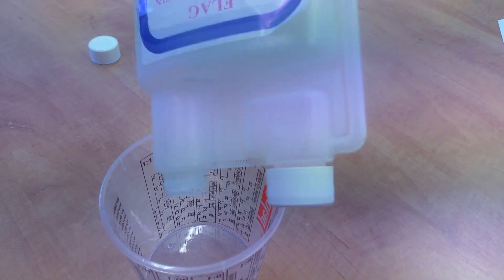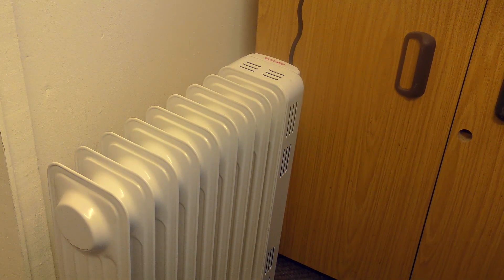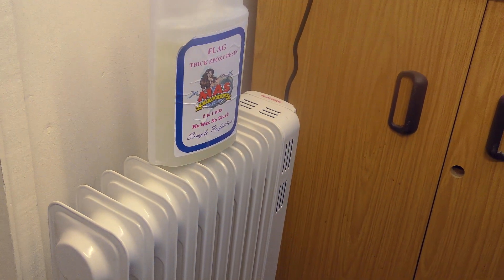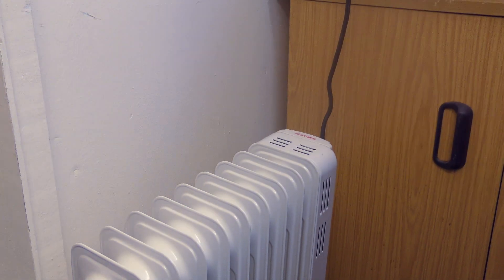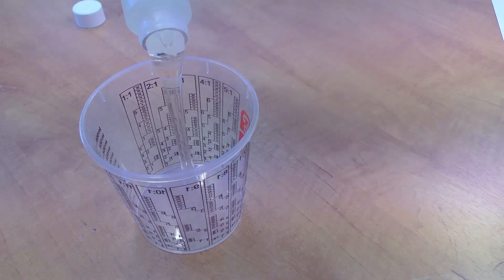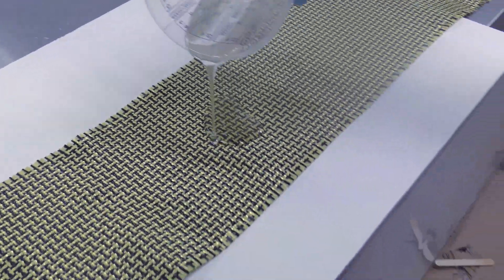Crystals can be eliminated by increasing the temperature of the liquid resin to about 50 degrees C until all signs of the crystals are gone. Usually this can be done by resting the epoxy on a radiator. Check the material at 10 minutes, 20 minutes, and at 30 minute intervals. Typically it takes only 20 to 40 minutes to eliminate the crystals and fully return the epoxy to a clear liquid. Allow the resin to cool at room temperature then proceed to use as normal.